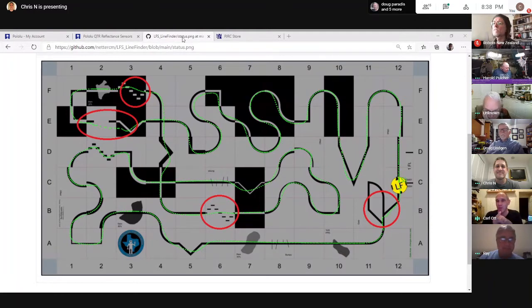But I'll tell you, this has been a really interesting session now with our contest coming up on the 12th, because I took a very different approach that last go around. It was straight machine vision, and I was doing feature extraction for lines. So I was identifying line segments, and then with those, I was figuring out which line segments were closest to the nose of the robot, and I was setting endpoints. So it was really deep logic, but it was pretty robust, if you could get a good CV going.